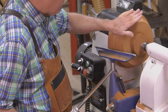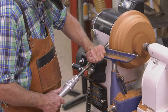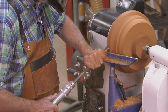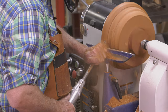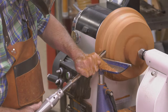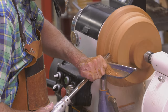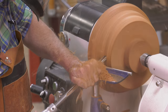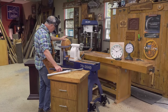Why do you want to learn how to shear? Because it virtually eliminates sanding when you shear the wood fibers with a sharp chisel. That third point of contact when I said three-point grip — it's my leg. This long handle is there to give me control. I'm throwing some nice shavings right now because this chisel is very stable.